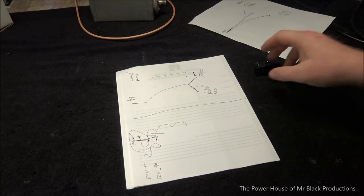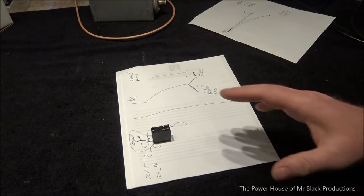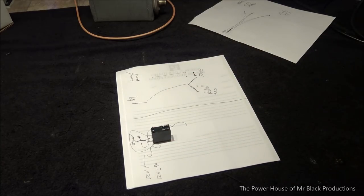Okay, so we're going to utilize the relay switch speed, and we're going to capitalize on the fact that there's going to be a time delay with the relays moving to make this system work safely. The other thing we have to take into account is ground potential differential in the audio chain. We don't want to create a ground loop. I don't want my friend to have to sit there and listen to an AM broadcast station or a hum or a hiss or anything because the grounds are all tied together inside the unit.